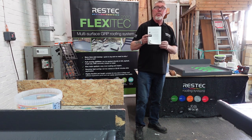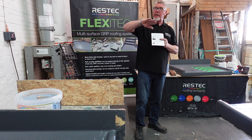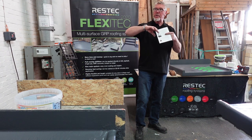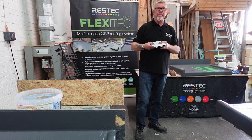Flat plate, if you're going to put a lay board on a flat roof, flat board to slate the roof, so you can put flat plate on the back of there, but you can get away with the fiberglass as well, but where it changes angle onto your flat board, bandage. Any detail change, anything like that, bandage first, and then take your fiberglass over it, okay?